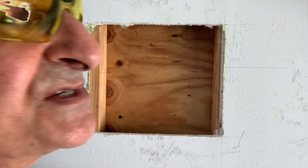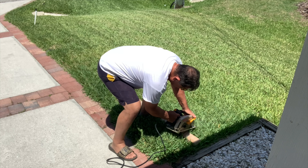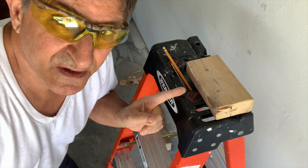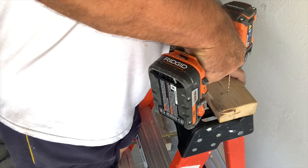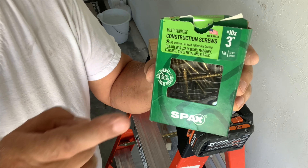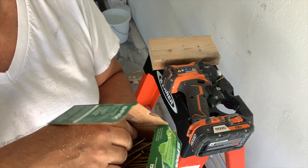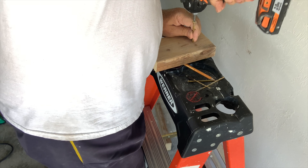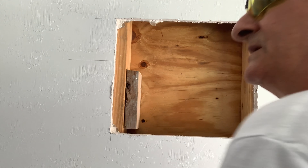Right there — that's where that nut's going to go. Just get a mark here. So my stud needs to go this way. I've got my piece cut and I'm going to place it like this. These lines will be the top of my vertical studs. I like to pre-drill my pilot holes. I like to use these spax screws — that's three inches, from Home Depot.